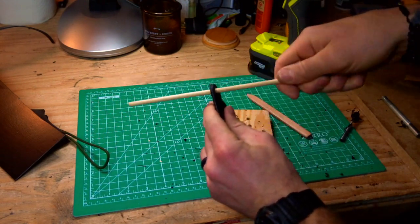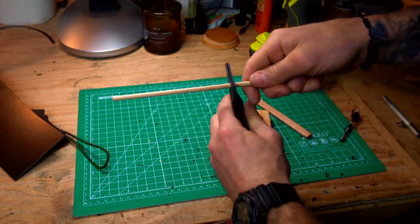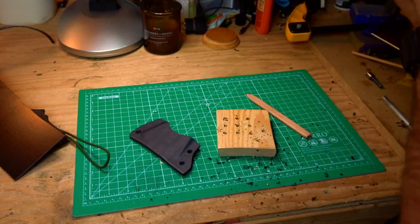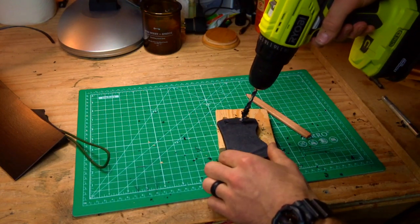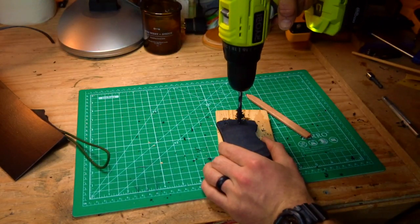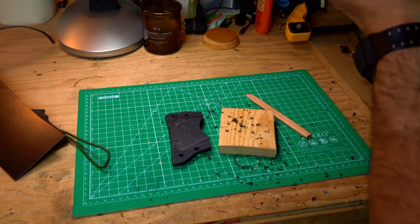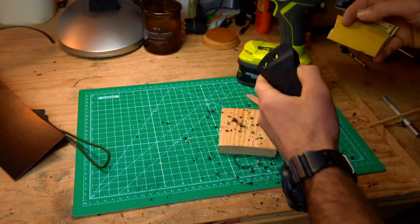After drilling, I take a bit of sandpaper and work on the inside wherever there are folds, and also on the holes — there will be fragments from drilling through the kydex. I like to take a wooden dowel and push through these holes to make sure there's no debris, keeping the sheath as clean as possible. There are a lot of times you'll find little bits stuck in there, so I like to wash it out once I'm done.